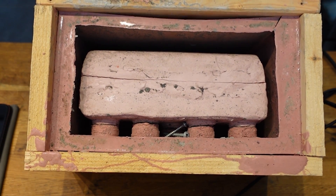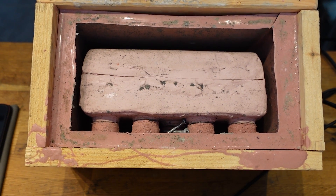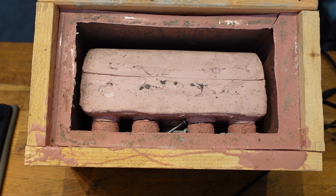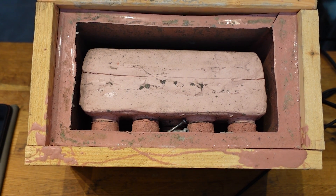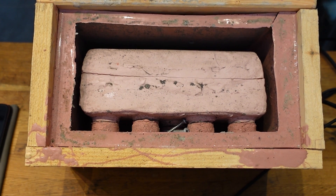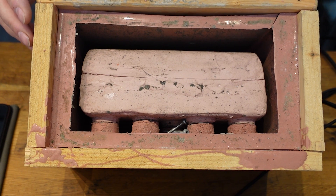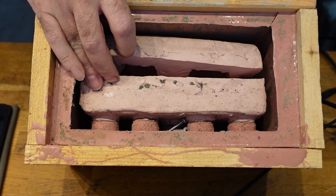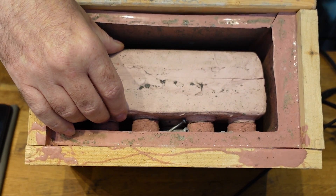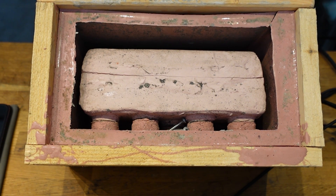This is the mold box. To make it I first made a clay mock-up of the enclosure and then assembled this mold box around the mock-up. I didn't really know much about mold making or how to cast complex shapes back then, so instead of using clay to build up a multi-part mold that I could easily take apart later, I just poured silicone over the mock-up and hoped for the best — which in hindsight probably wasn't the optimal solution. I had to cut into the silicone and pry it open since the inner part was now a solid block of really hard silicone. But I managed to end up with a couple of decent casts.